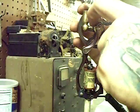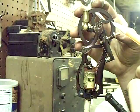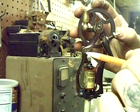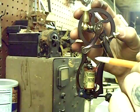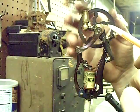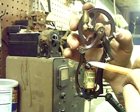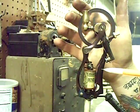We've got a cam built directly on the crankshaft right here. I've got little bronze bushings pressed in here. Here's the crankshaft — little one-eighth hardened pins. Little connecting rod. There's a set of points right here. Whenever this cam gets it just right there, it lets the points contact, turning the coils on, and of course pulling the A-bar over to them. And that's how it runs.